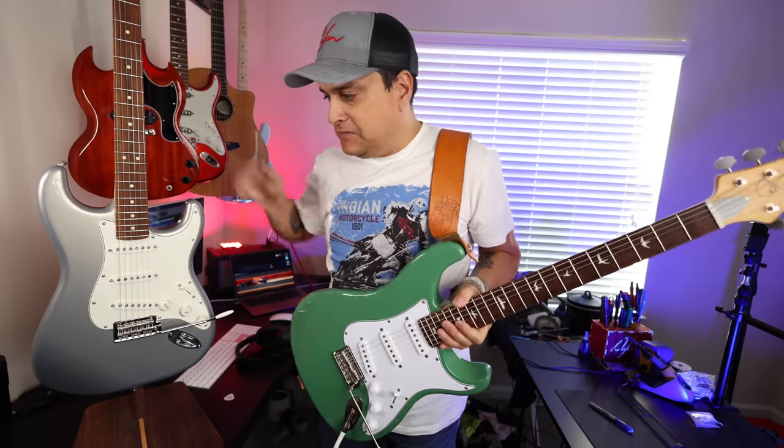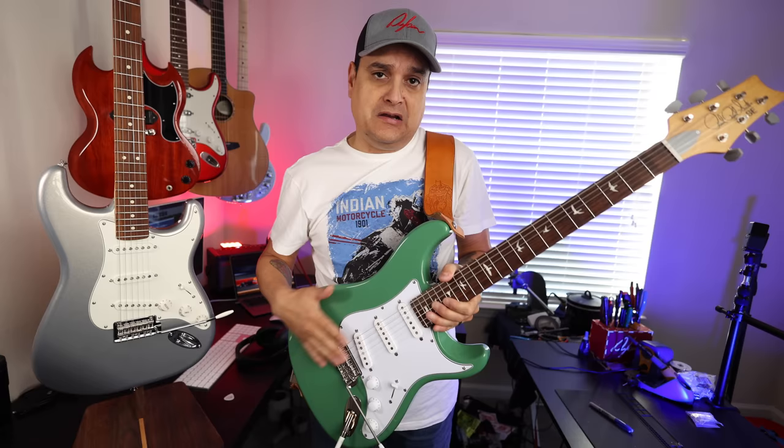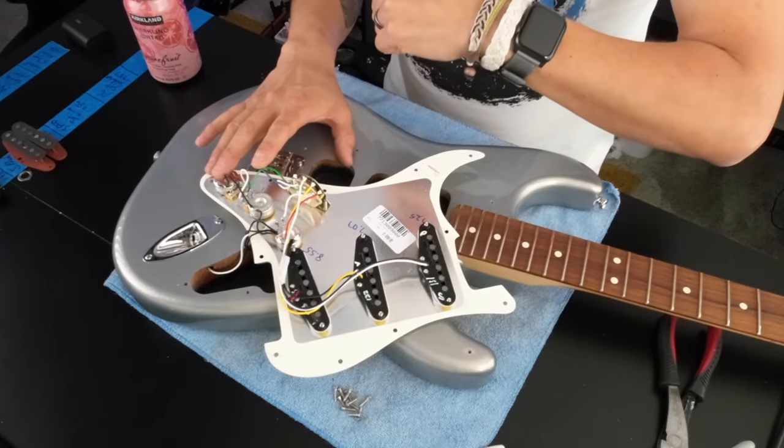Now that we've seen and heard the major differences, we're going to measure some necks, measure some pickups, look at pot quality, and look at what's inside. Let's do bad news first. These pickups are a little anemic sounding to my ears. I wanted to figure out why. When you check them with the meter, the DC resistance is really high — super lots of winding: 7.25K on the neck pickup, 7.97 on the mid, and 8.55K on the back pickup. You'd think that's wound super hot, so why do they sound so anemic compared to the Silver Sky SE?